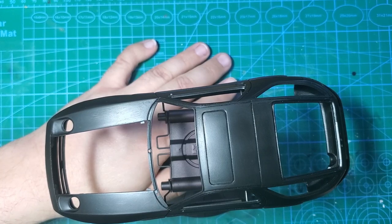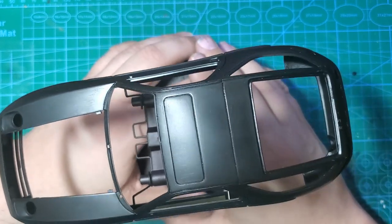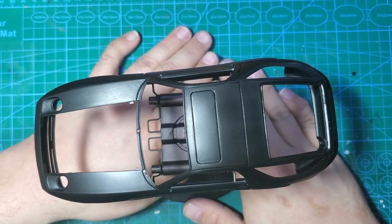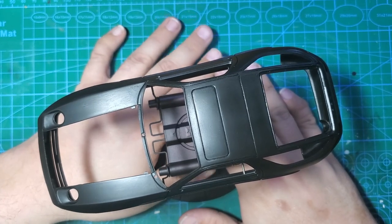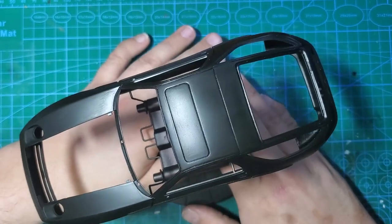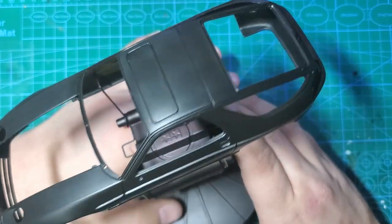So I added this step in just because I've had some issues already. I'm taking extra steps to try and reduce as many problems as possible. I did add this and it really helped. The UMP primer went down perfectly smooth - no spots, no clogs, no sputters. This is a beautiful self-leveling primer anyhow. And just adding that little step of straining out any potential gunk really helped.